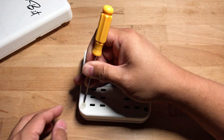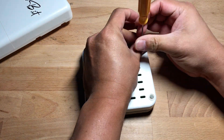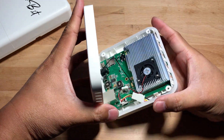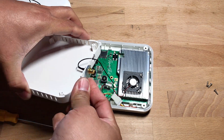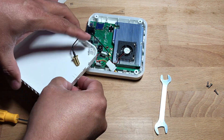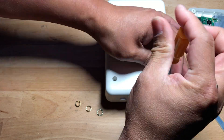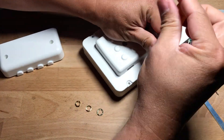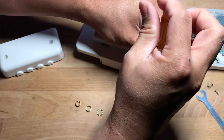To put it in the outdoor enclosure, first take off the little plastic feet, then unscrew and open the whole device so you can take the electronics out and place them in the outdoor enclosure. The new version 2 comes with a fan and cooling system, which also makes me want to put this outdoors. Once you've opened the top, disconnect the antenna. The outdoor enclosure has two sections: one where you connect all the plugs, and a back section where the electronics go.